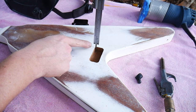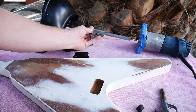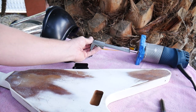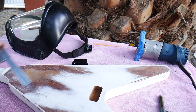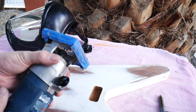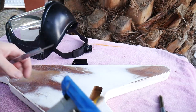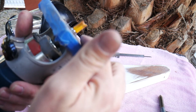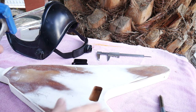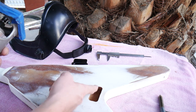We still have quite a ways to go — probably close to a half inch deeper. We're going to set our router so the bit comes that far through the bottom, currently about a quarter inch deeper than needed without the bracket on, and we'll adjust it to match, maybe just past that length by a sixteenth of an inch or so. Whenever you make any type of adjustment on the router be sure to unplug it — it's a super dangerous tool and if you accidentally hit the power that bit's spinning super fast. There's a bracket you can loosen and readjust to control how deep it's going to cut.